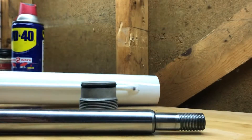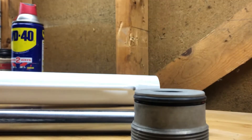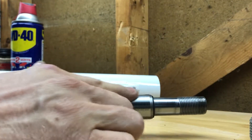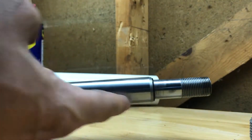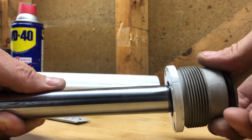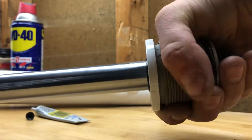Now to put the parts back together and into the cylinder. Take the head and put a little lube on the shaft itself — make sure the shaft is nice and clean. I'm using Super Lube, just a small amount so it has something to slip on. Then put the head on — it just slips over the end, give it a little turn. It'll cast the seal itself and slide on with a little rotation.